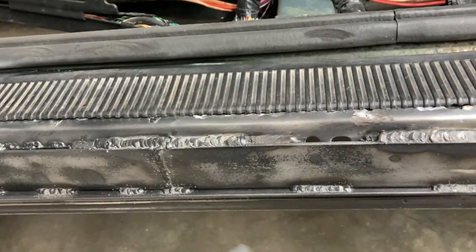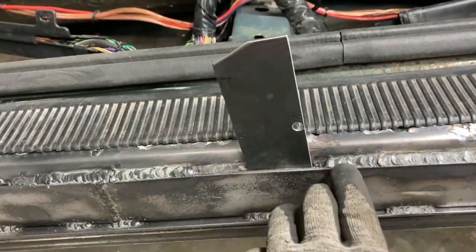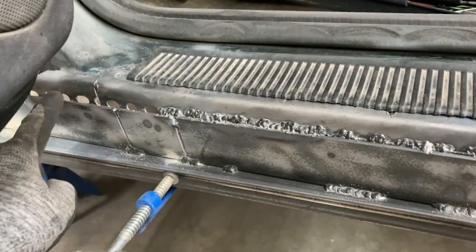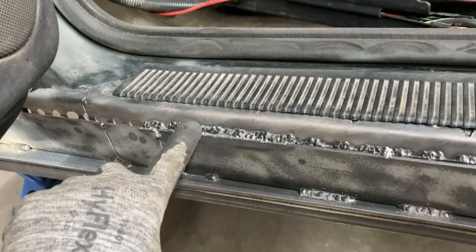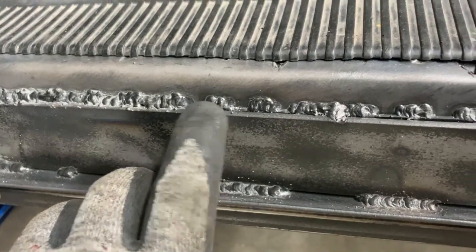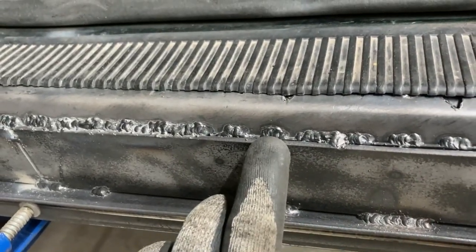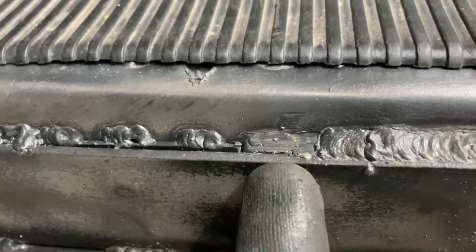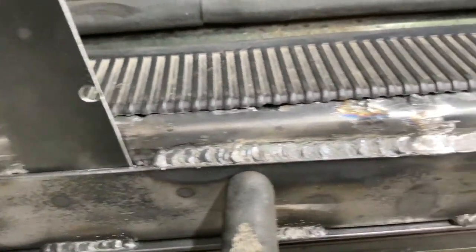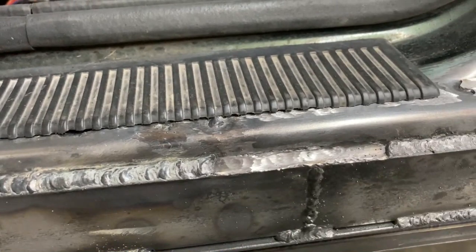Where we've got a gap, I take a piece of scrap steel, fit it into the gap as far as it'll go, mark a line on it, cut it, and put it in to fill the gap. Looking over here, there doesn't end up being a gap to fill — I think up to about here was where I had to put some filler metal in. What seemed to work best is you put that filler metal in and then basically tack the openings and holes from this piece, then knock it down with the grinder. After it's knocked down I run a bead in, and hopefully when it's all said and done we can knock down the high spots on the bead and maybe achieve a nice radius in here when it's all ground and finished.